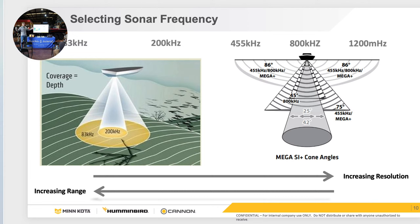When you start side scanning or scanning down imaging in deeper water, using the mega frequency beam it's going to start to black out past about 100 feet. So if you're scanning far distances or in really deep water, bump it down to 455. For Helix, just hit the check mark and toggle between 455, 800, and 1.2 megahertz. For Solix, go to the top bar preset. But use mega most of the time — that's going to give you the best detailed image.